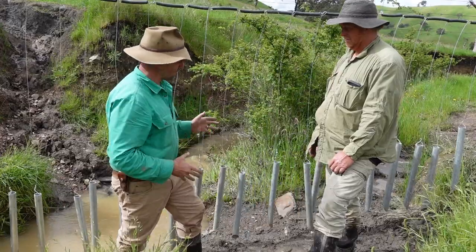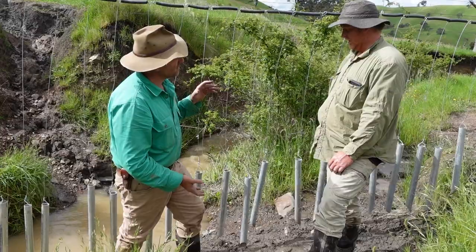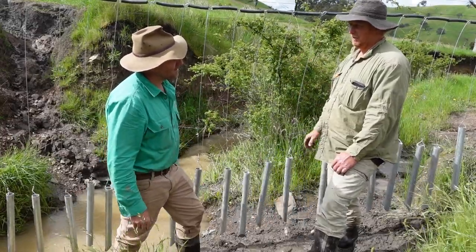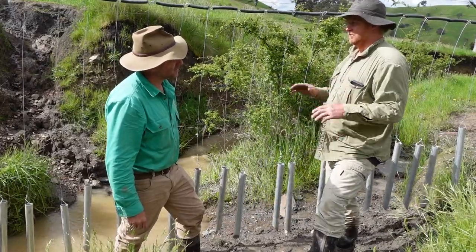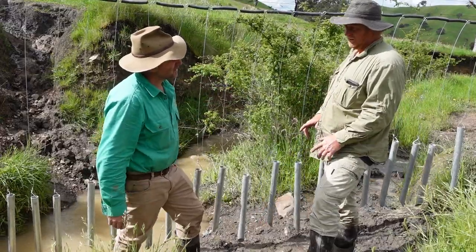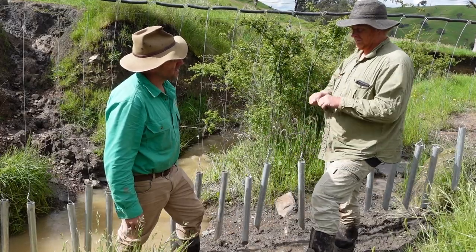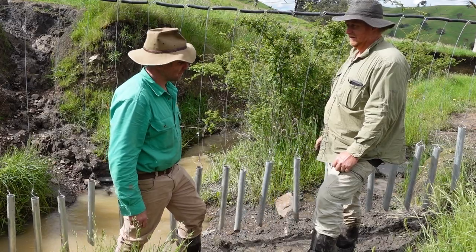So learnings from this were that the pipes that we were using were perhaps a little bit too long. And a bit too heavy, because the sag, as you can see, there's a little bit of a sag. We had it straight when we had no wire on it, no weight on it. Yep. And as soon as we put the weight on, we started to sink. Just started to ease in a bit. And the fence stays haven't moved. Yep. We've checked them 3 times already. They haven't moved. It's actually the wire and its core strength is starting to stretch. Yep. And that's all it is.